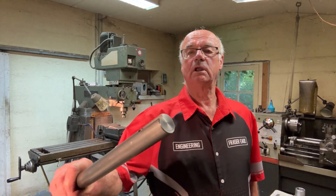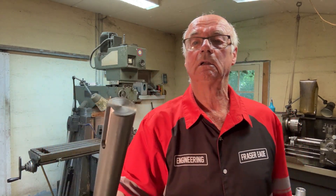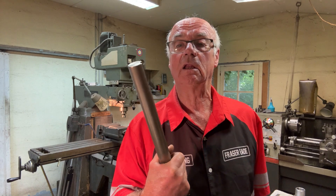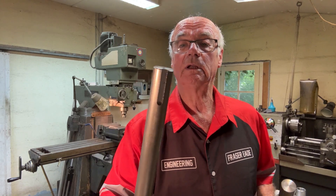There you go — that's another little job complete. The old Beaver did quite a nice job on this. There's the keyway cut in the end — an 8mm keyway, four millimeters deep. The key that goes into it will be 4mm by 8mm — half and half. Hope you enjoyed the video. Look out for more videos in the future, and if you haven't already done so, please subscribe. Thanks very much for watching, goodbye.